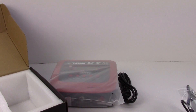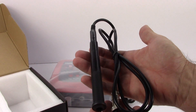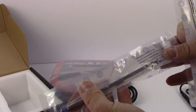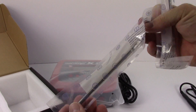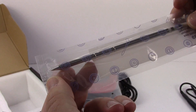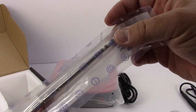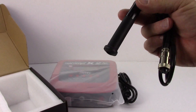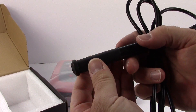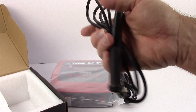Now for the fun stuff. This is the main unit for your actual soldering iron, and it looks like we have two different tips — both sealed almost like in a medical bag. We have a chisel tip and a pointed tip, both very fine. Really like the idea of these. They just snap into the gun handle, which has a nice rubber feel to keep your hands away from the heat. At 840 degrees that's nothing to squawk at — pretty nice design.